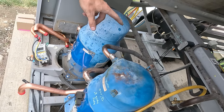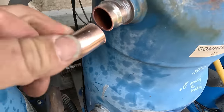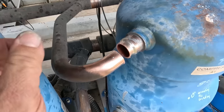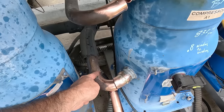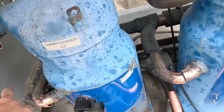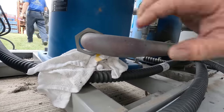I took all the brackets off back there so we had more play. This is probably the least amount of shavings you're going to get with that method — just that little bit there, which obviously would screw stuff up. By doing it this way, we don't have much fall here. I'm going to cut it with a pipe cutter like you're supposed to — this will allow us the room to get this out. You're not going to get a pipe cutter big enough for what I think is inch and a half or bigger. Getting a pipe cutter that big is going to have a handle all the way out here and you can't swing it. I could have unsweated it, but as tight as this is, at one point or another you need to cut it. So we've got these oil equalizers on here.